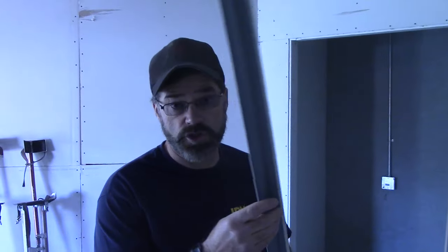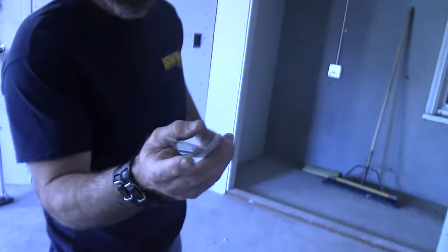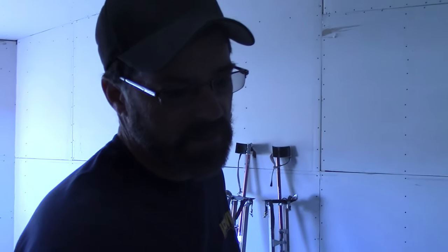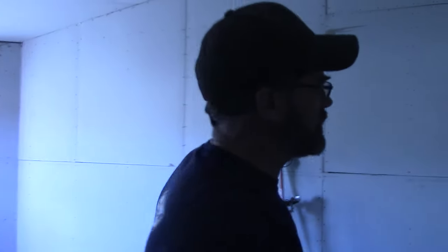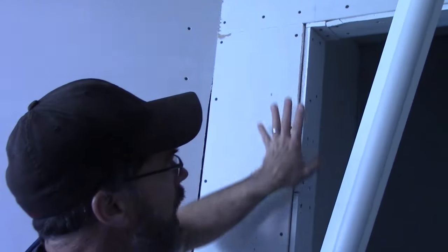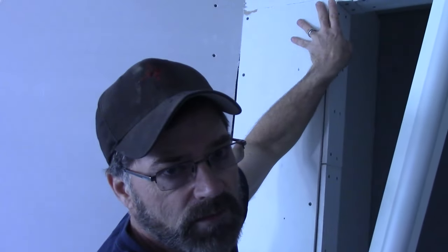They already hung the job, so I'm coming in here now as the taper. We're also going to be applying bullnose corner bead — that's the round stuff — and that's going to go in all of the closet wraps and the door wraps. They're going to wrap the windows with wood. So first thing we'll do is hang this corner bead, and I'll show you how to cut these corners so they fit nicely with no gaps and it's easier to run that metal. Let's go ahead and get started.